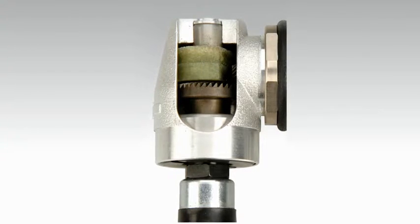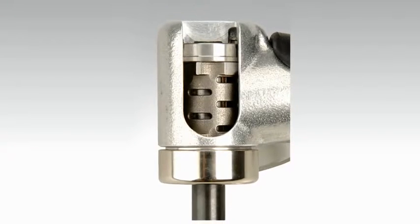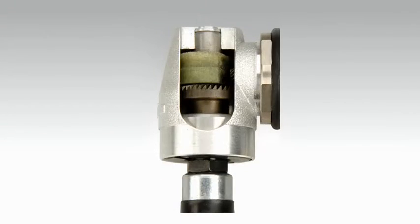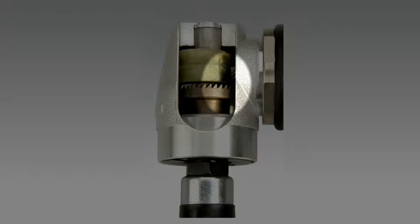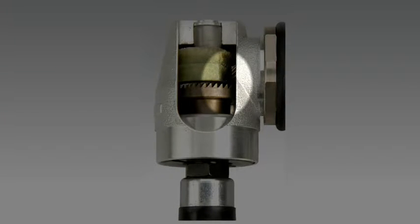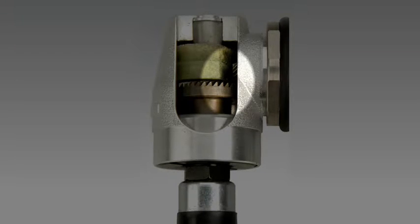The next thing is the gear tool — beveled right-angle gears. That's the gearless, and you can see the direct drive motor right in the head. Here's the gear-driven tool. Now you can see what a beveled gear looks like — those two pieces that create that right angle. You can see where the teeth mesh with each other; those are your beveled right-angle gears.